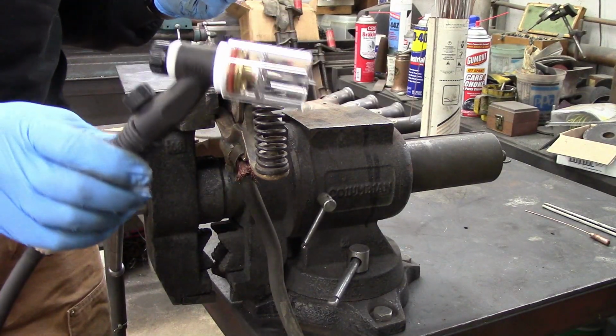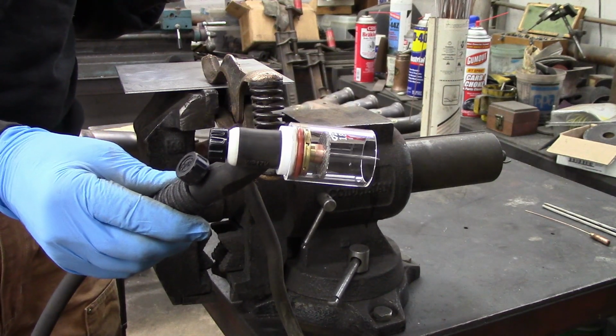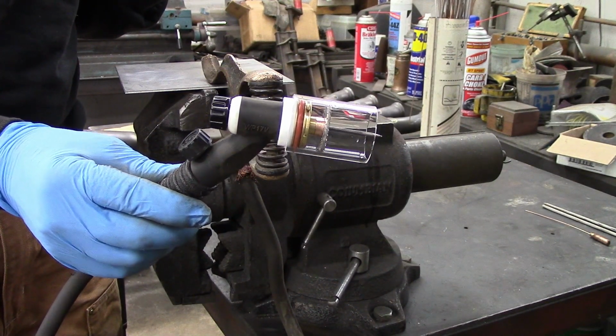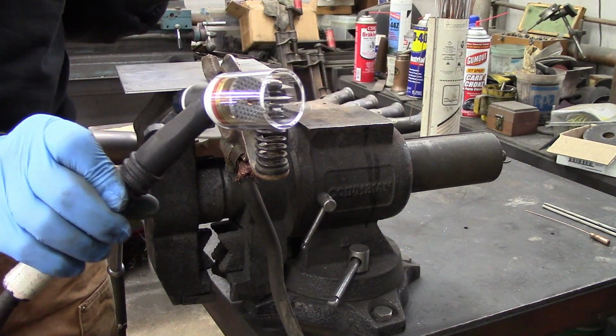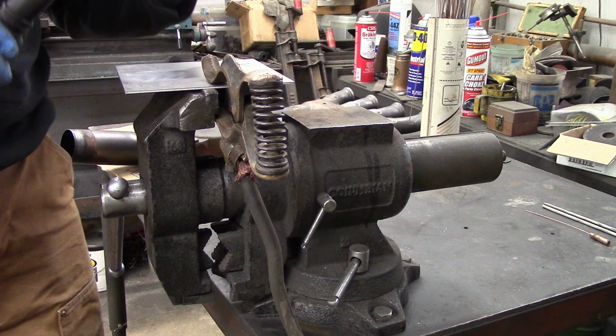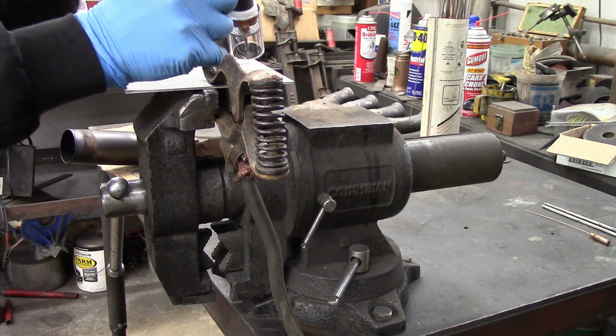I have what's called a jumbo champagne cup. It's an 18 cup that I purchased, and it's really big. 3/32 tungsten, and I've got 1/16 filler wire, titanium filler wire. Now I did not touch on it, but I am also using a foot control, so those pulsed arc settings that I have are only going to be whatever I operated at with the foot control.